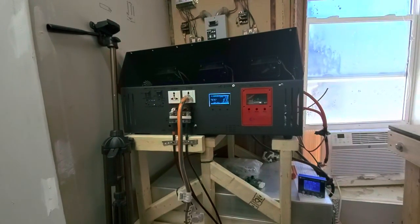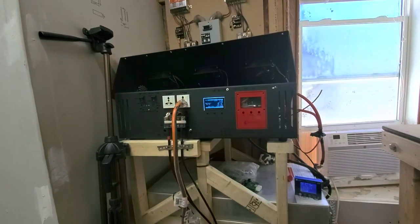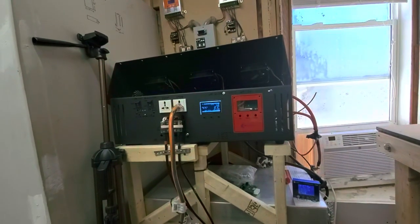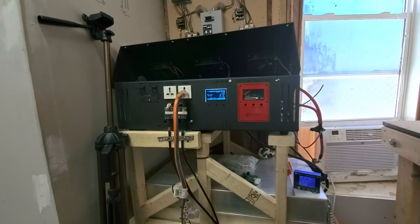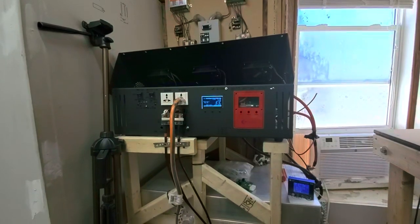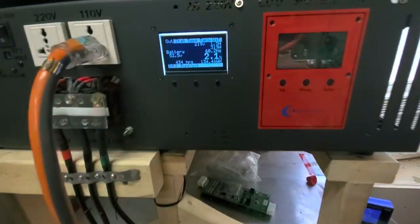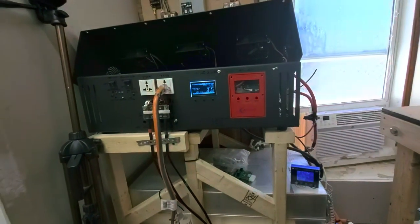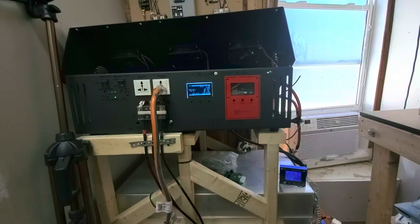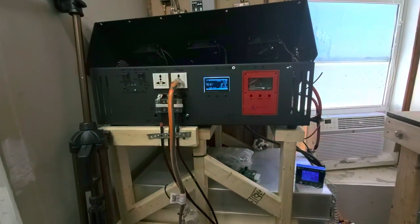When I went to bed I was at just slightly under 56 volts — about 55.8 — and I woke up to about 52.9 volts. It fell further because I got up at six o'clock, the sun wasn't even up, and I had my shop lights on, opened the fridge a couple times, and used the microwave. But the point is that overnight while sleeping I dropped about 3 volts on the pack, which I don't consider bad at all — especially since I didn't go to extremes to eat every watt out of it.